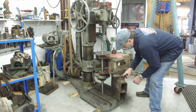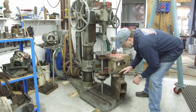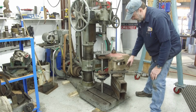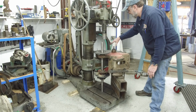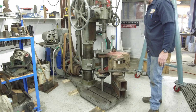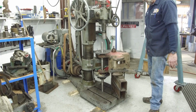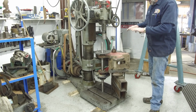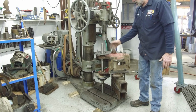And there's about 1/8 of an inch to 1/4 inch gap in here, so we're going to lower our table down, and we're going to tighten this down here, and then we're going to lock the table and lock the swing of the knee support, and then our part is located where it needs to be, and that'll stay secure. And then we finish setting, raise this up, and put our bar together.